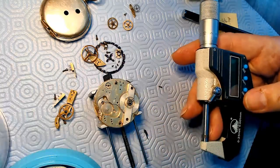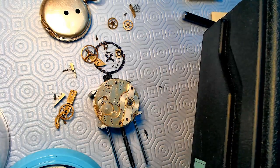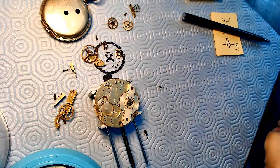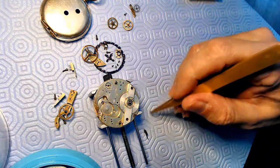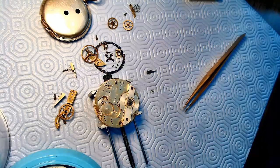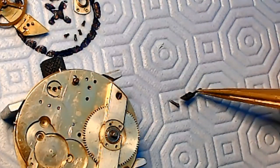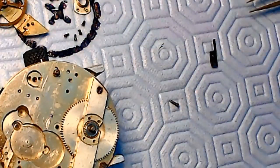I put the battery and the micrometer back in the case. So I have the screw and the original spring which I might retain depending on how I fashion the new one. Let me get a close up of that spring. There it is - I'll turn it sideways and there's the spring with the stud that goes into the watch right here. So the thickness of this thing was 0.34 millimeters.